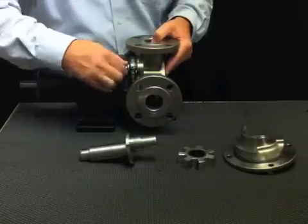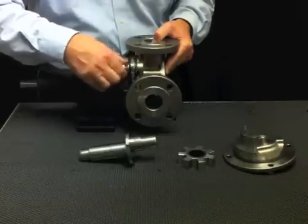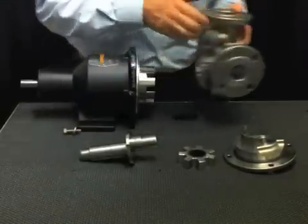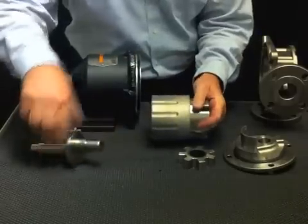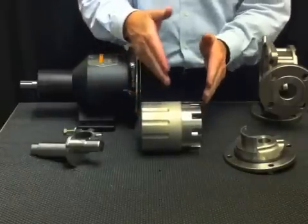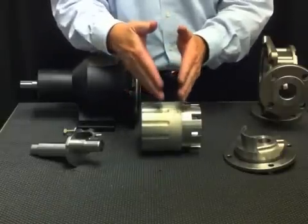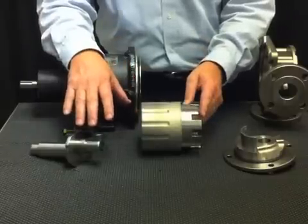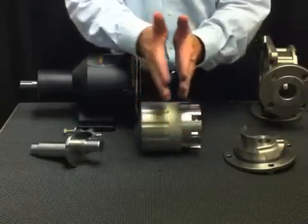Continuing to disassemble the pump, I take the casing off. Casings are available with a variety of pipe connections, either threaded or flanged. We also have the option of side-ported casings, and the casings can be rotated to accommodate your current piping arrangement. The next piece is the rotor assembly. A key feature of the Envirogear is that it is based around a one-fluid chamber design. On a traditional pump you'd have a rotor gear and idler in the hydraulic chamber, and an inner set of magnets in a magnetic coupling chamber, separated by some kind of adapter plate or bracket. Within the Envirogear, we took the magnets from the rear chamber and mounted them right on the back of the rotor, essentially taking a two-fluid chamber system and creating one.